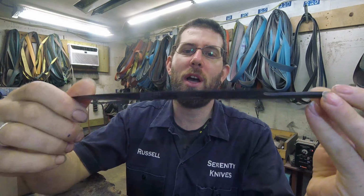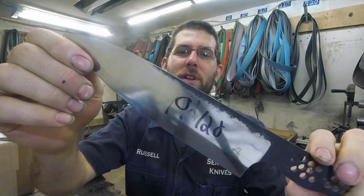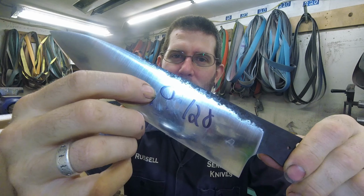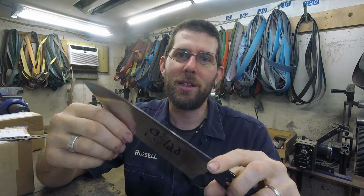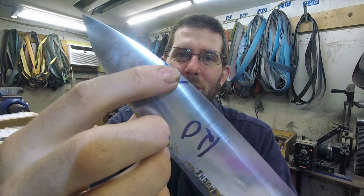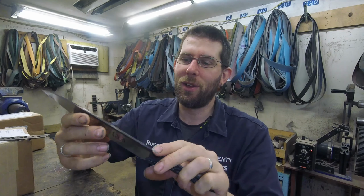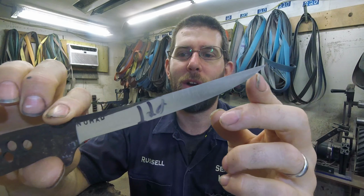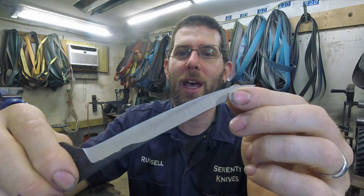I will be continuing grind lines. So I got some good grinding done on the three I'm working on. There's one little spot here, which is basically just some deep forge scale from the heat treating process. Get those out, and I'll be running through the grits on that one. And this one is already ready for 220, so it's a little bit ahead.